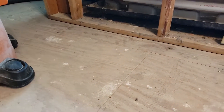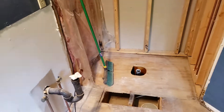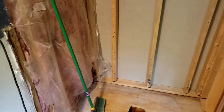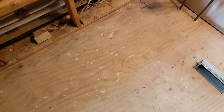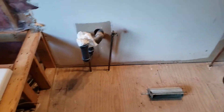Then I'll do the self-leveling first. I'm going to put new cement board there and there. I'm going to build my shower curb with a little half wall here, just like it was before — it'll go right to there and then out to that joist. So what's next is: repair the subfloor, put up the cement board, get out all the staples, seal it up with silicone, then pour the self-leveling.